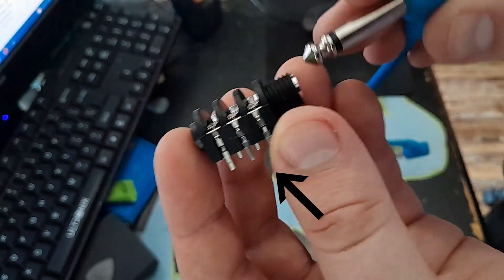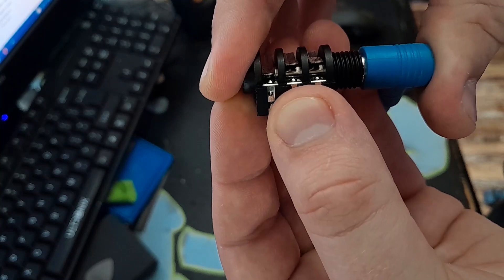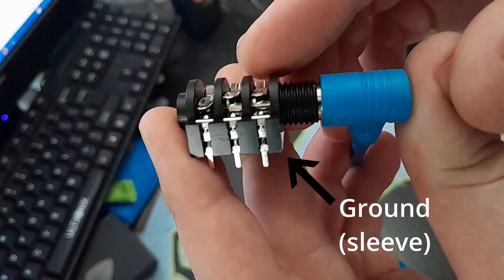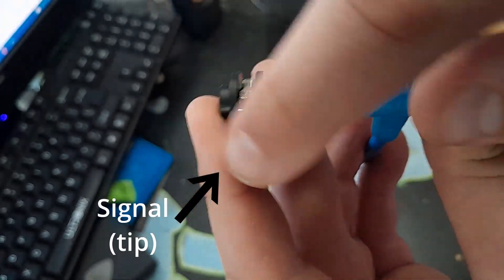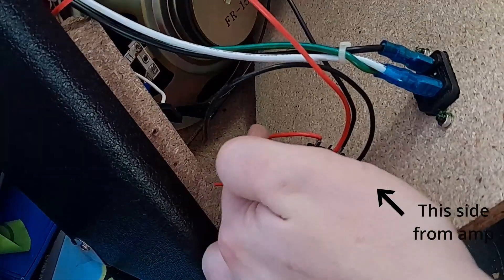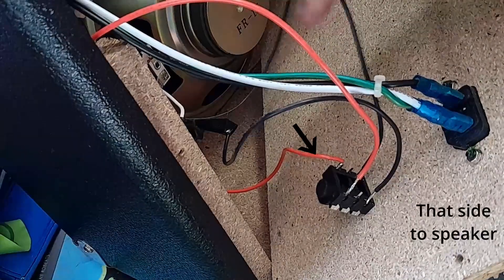We can see this by plugging a cable into it — these other leaves lift up off of the short legs and connect to the plug instead. We attach the speaker leads on the short side with the ground wire to the sleeve lug and the hot wire to the tip lug. Then we attach the matching leads from the amp to the same lugs on the other side. That's all there is to it — you're just wiring basically straight across the jack. Without a cable plugged in, you essentially have the same signal path as before; the leads from the amp travel across the jack without interruption to the speaker. But when you plug in a speaker cable, this side disconnects and the amp leads are shunted to the speaker cable instead. Then all you have to do is find a reasonable place to drill a hole so you can mount the jack.